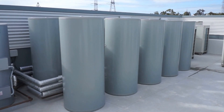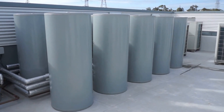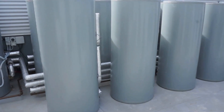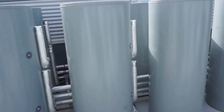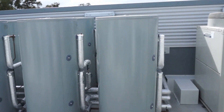Those primary tanks are pre-heated from the Apricus storage system. There are 10 storage tanks of 400 litres, and our collector field is dumping pre-heated water into these vessels before they go through the primaries. The sun is actually just starting to break through now, so we'll start to see a bit of an increase in temperature.